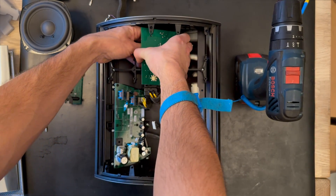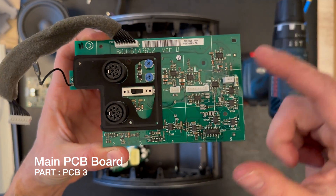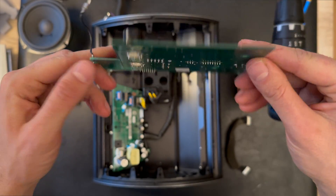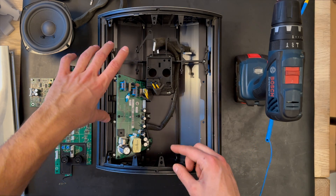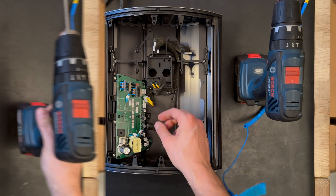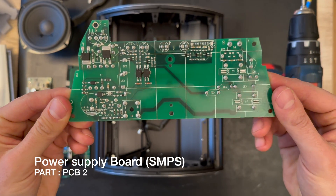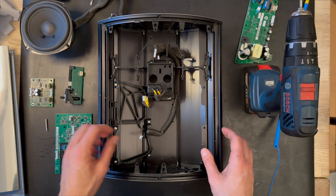The main board is held by two cables. Here is PCB board 3, with the two PowerLink inputs and the switch for right/left and line-in. Next, we're going to remove the power supply board, which is held by six screws. All the screws are removed and we can lift it up. Here is the power supply board — it looks very different from the MK1 version.